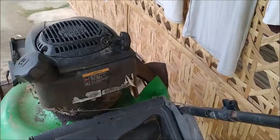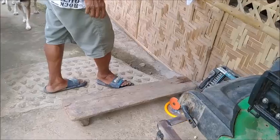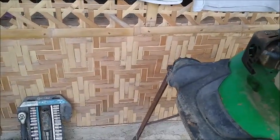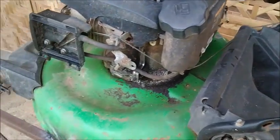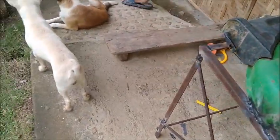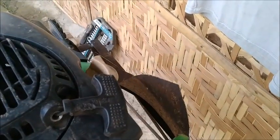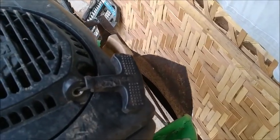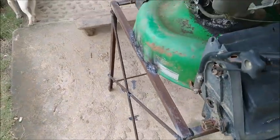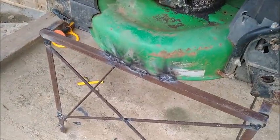So we've got to put the intake chute on it. And Tatai wants to put a — I don't know, I guess like a splash guard on it for leaves, to catch anything that blows out. There is going to be a little bit of downforce. That was the reason that I changed the pitch of the blade. There has to be downforce. Like it was, we would put stuff in this top chute and it would just blow back, because this would be acting as a discharge chute. But because we reversed the pitch of the blade — that was the whole purpose — so now it'll suck things in through this chute, but it'll be forced out the bottom.